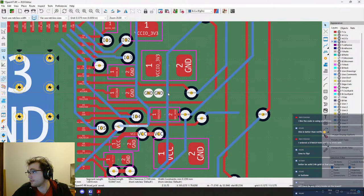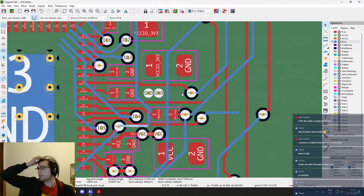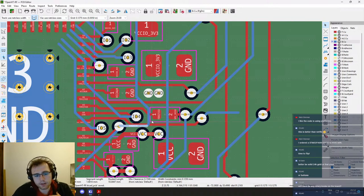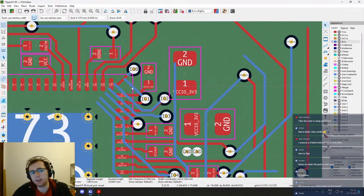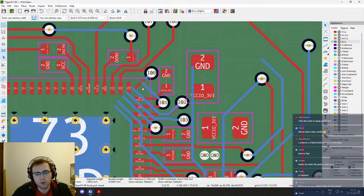The code is using PlatformIO. We don't have any code yet, I think. What I planned on doing, but as we said, it's not a final decision, was to use CubeMX, because their code generation would help us a lot in speeding up the process. They have FreeRTOS, which is already ready to go. Just need to click to enable it. And then you can use all the ST libraries, which are quite okay. It's not the most efficient, but it's not the goal of this proof of concept. We won't be aiming for crazy battery life and so on. We just want this to work and to prove that the concept is valid.